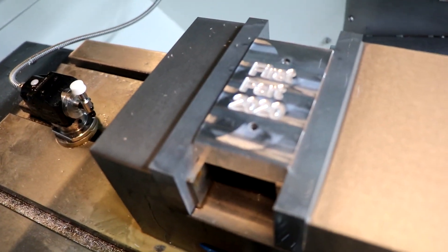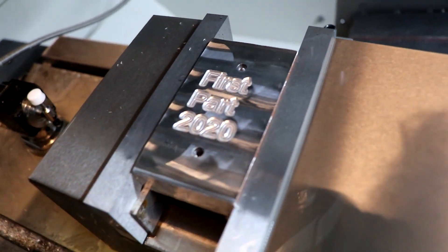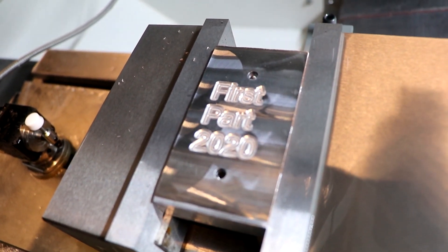Let's see what's been made. I just did the back part of this part — I did that yesterday. Yesterday was the first cut. First I did a facing operation and then an engraving operation, and I think for someone as novice as me, it looks quite good. I'm really happy with the machine now that I have it up and running. There are still a lot of things that need to improve, but it's mostly due to me — I need to improve. I really hope you enjoyed the video. If you did, please subscribe, and you'll see this cheap mill with epoxy casting cutting titanium very soon, because we're going to make some knives. Thank you very much and hope to see you next time.